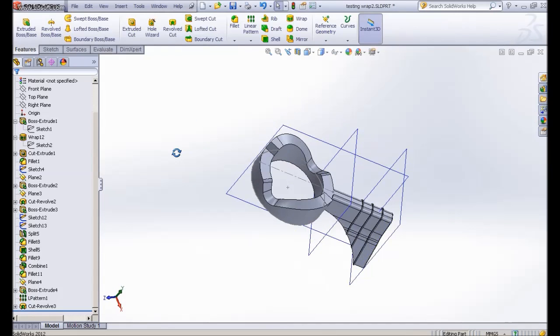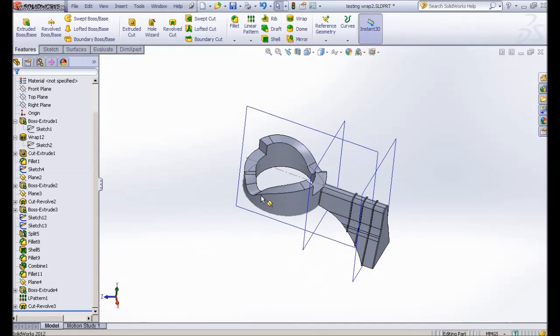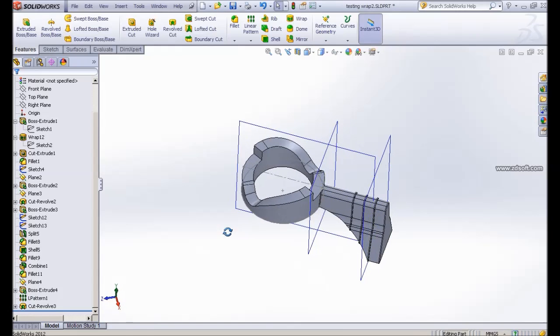This is what I've done in SolidWorks. If you look at the components, we have the slot here, the curvature upward, step down, flat surface, downward, groove. We have a groove, then upward, flat surface, downward, flat surface. There's a groove. What I did is I used the wrap command, so it will wrap around the cylinder to form this thickness. Then I subtracted it by using the inner diameter to extrude cut to form the hollow cylinder. Let me show you my starting point.